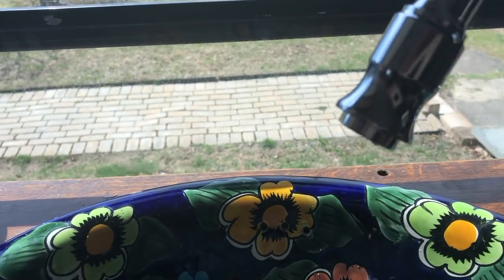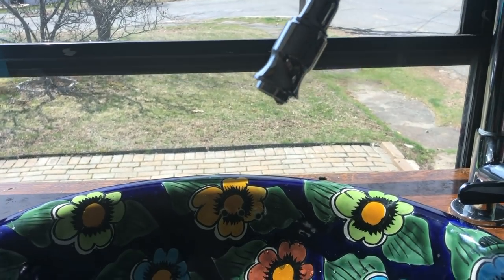Okay, everything's in place — fingers crossed. So now when I step on the pedal, I should feel it kind of fill with water. Yep, I can feel that. And if you look at the lines, the water lines are filling with water. The lines are full, so now when I step on the pump again I should get water — but first I've got to flip the handle to open the faucet. Okay, faucet is open. I'm going to step on the pedal and... wow, there's water! There's water coming out! So you can see the sink is filling with water, and if I lift the basket, it's going to drain down the drain pipe and into the gray water jug. Eventually I'll get a shutoff so there's not water in the lines while I'm driving, but I haven't figured that out yet — and this is very cool.